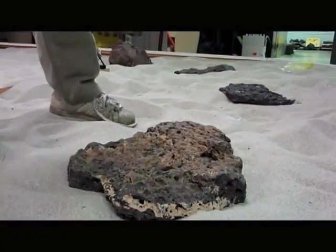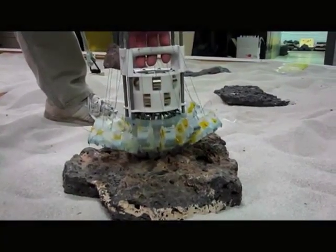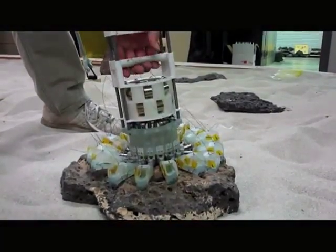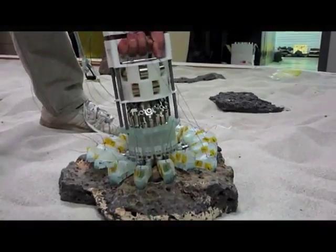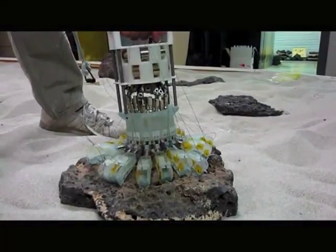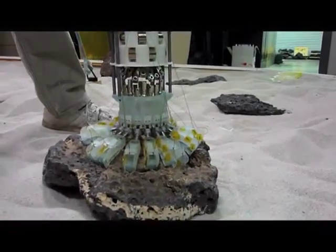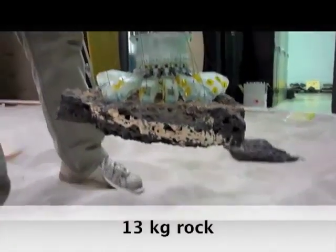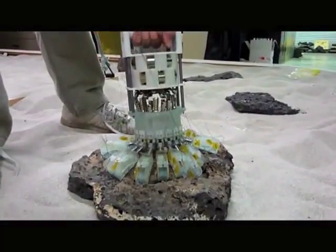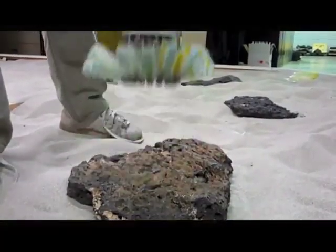Anchors use a new hierarchical configuration of microspines, with 16 independent carriages each housing 12 microspines. Torsion springs bias these carriages into the rock surface and an engagement degree of freedom drags the spines across the rock, establishing an anchor, seen here lifting a 13 kilogram rock. A disengagement degree of freedom releases the anchor with less than 10 newtons of force.